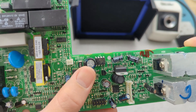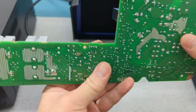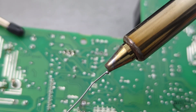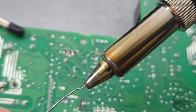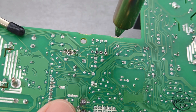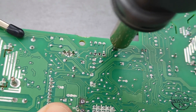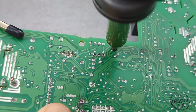Let's remove a component with the desoldering gun. Turn on your desoldering station — I set the temperature to 380 degrees Celsius. Add some solder wire to the tip of the nozzle; this helps the gun heat the joint quickly and efficiently. Place the tip of the desoldering gun on the joint, press the trigger, and the vacuum will pull all the solder away. While you're sucking up the solder, gently move the tip in a circular motion to make sure it's clearing out all the solder from around the pin.